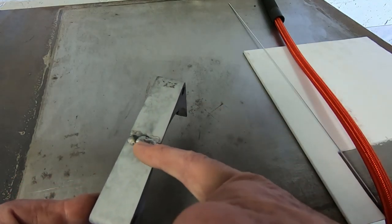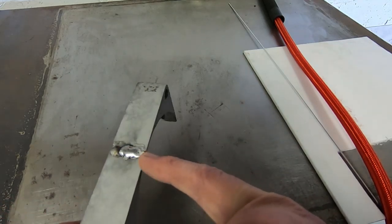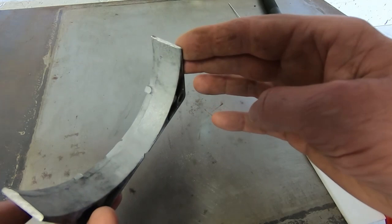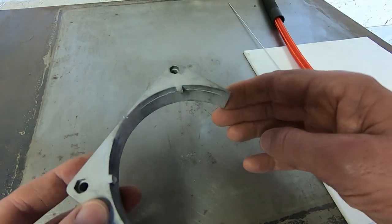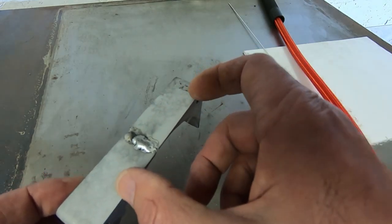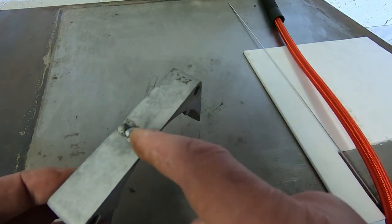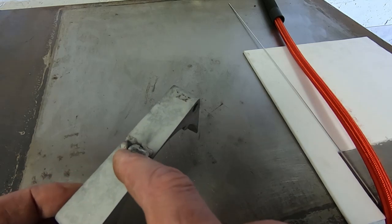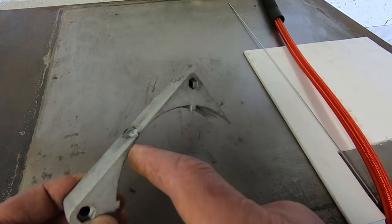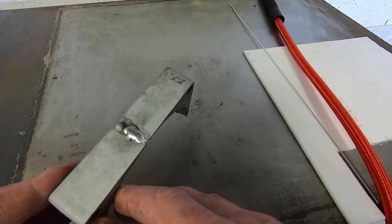But what we're trying to achieve here is a continuous weld, and then, as I say, at this point you'd normally go back, finish filling in any voids, and then we can take it away and finish the grind process. But this is just a test piece, so I'm not going to do that. I'm just trying to get the process settings right to make sure that it's successfully welding all the way through. So I'm going to go and grind this area away now and make sure that the weld has penetrated all the way through the material, and if it has, we can then move on in the next video to repairing the actual part.